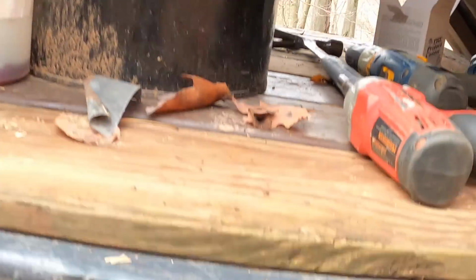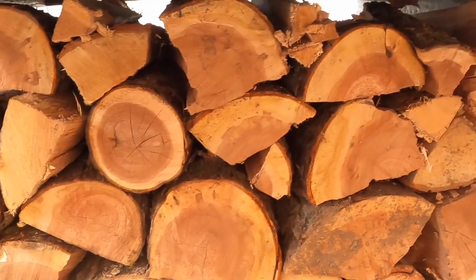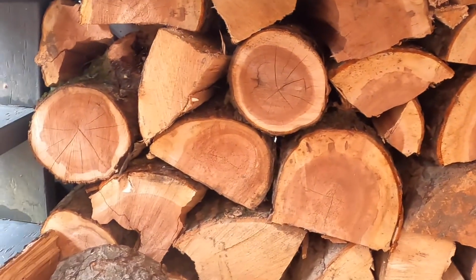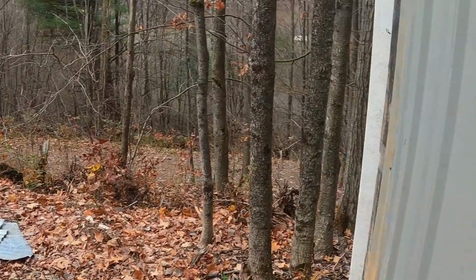All our wood down in here is underneath the tin now. The wood will be kept dry and the wind will come through and season it nice. So we're done with this side. We need to finish this side. So first, we're going to replace all these drywall screws with regular tin screws, and we'll do that first.